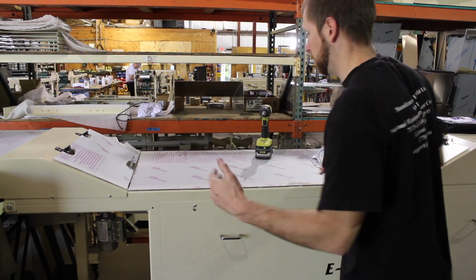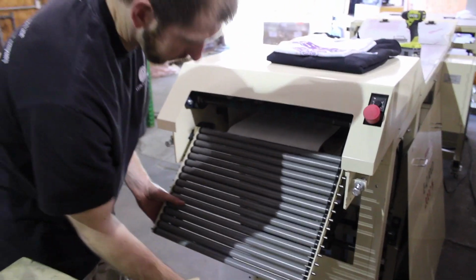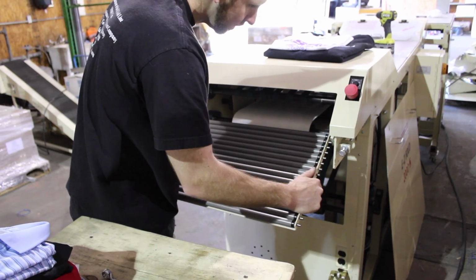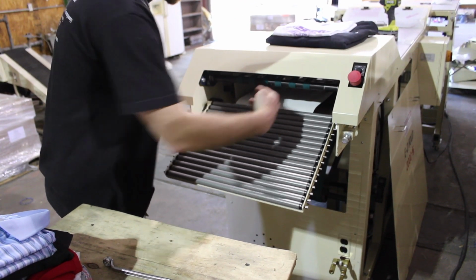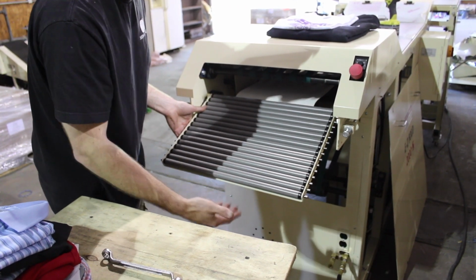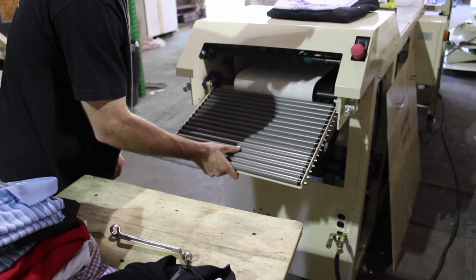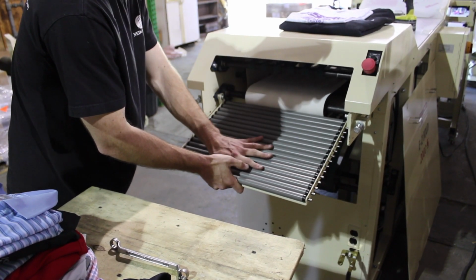Okay, so let's keep moving. Again, there's going to be a wire. Cut this wire at the end of the machine. These blocks rotate. It's a 1/2-inch wrench. These need to be as close to this bearing as possible on the top side, so when the product comes out, it rolls directly out on the rollers down onto the bagger sealer. Do not leave this thing down like this. That is not how it's supposed to be. When your product comes out, it's going to turn, hit this, and roll up.